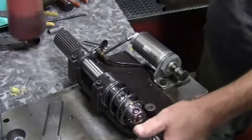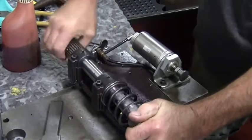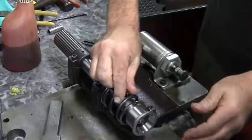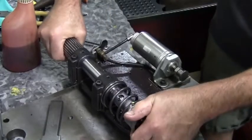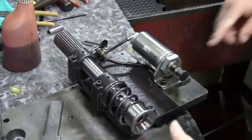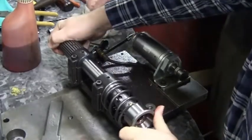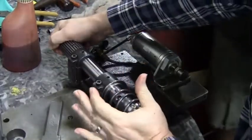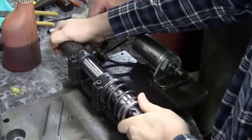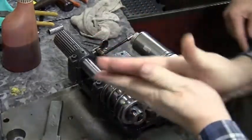Once again, you'll see it's not easy at the end of the shaft to start the collars on. A good method is holding on to the hand wheel while wiggling the shaft. Turning sometimes helps. Slide the first collar on with the keyway up. Once you get close to the keys, install the other two balls in the back before sliding the collar further onto the shaft to capture the balls in place.